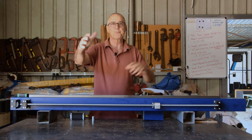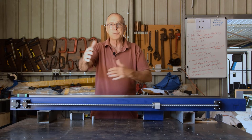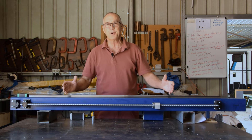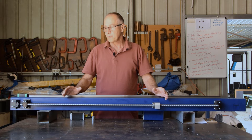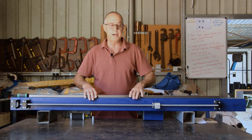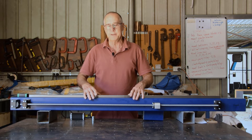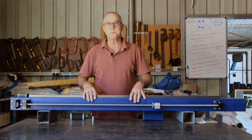Basically the footprint is 1,800 mm and I thought I'd easily get 1,200 mm inside. If the frame was too big using the components I've got, I can always trim it down at the end. The frame rail itself is 100 by 100 by 3 mm painted box section — it might be a bit of overkill, but I need something solid and rigid and that's why I went this way.